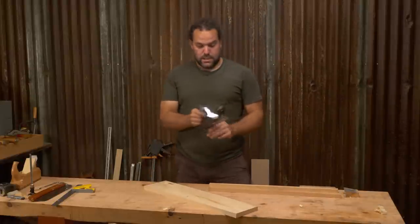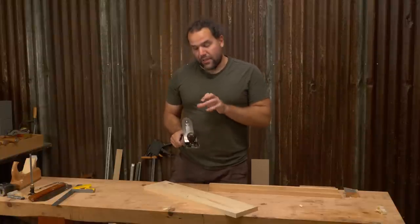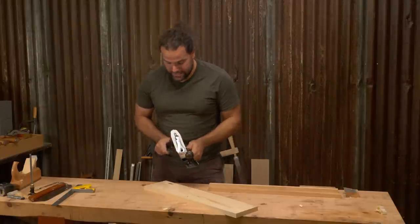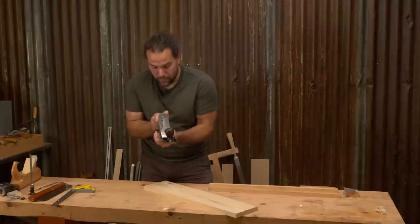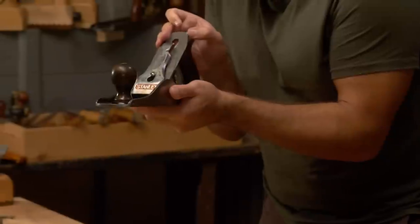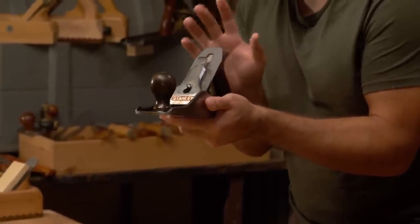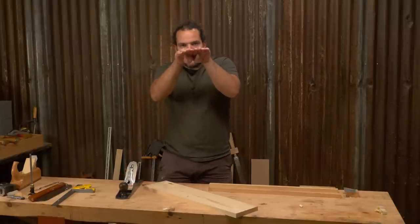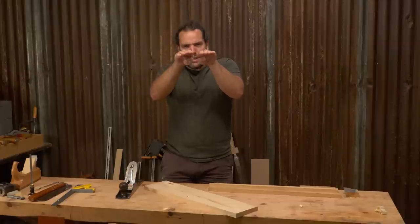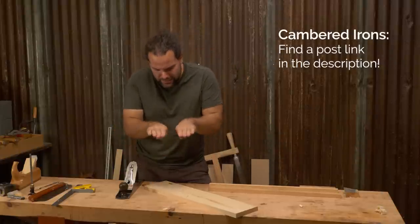This also brings on a little method that I normally would tell you never to do, and that is lateral adjustment. What I mean by that is — see how I can adjust the iron with this. If it's a wooden plane, you just whack the iron. The reason when I'm doing edge planing I tell people not to do that, is because when you sharpen your iron, it's always going to have, even if you aim flat, an ever so slight radius. And the coarser the iron, the more radius you want. So if we're doing something like this, it's a bit general purpose — we're going to have a little bit of a radius.